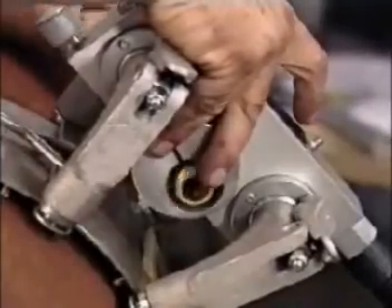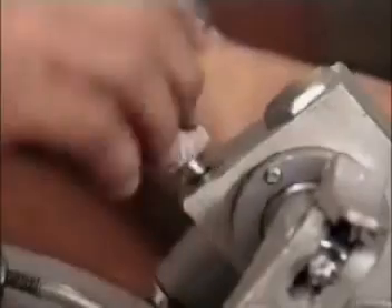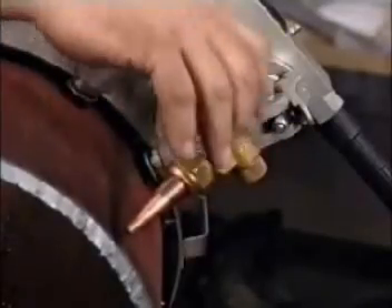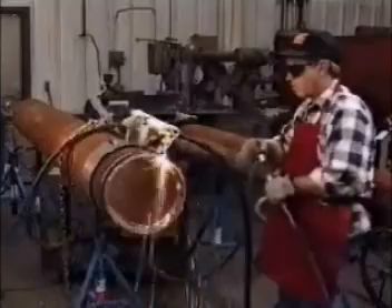Then secure the legs, making sure the crawler is not attached too tightly as this can cause irreversible damage to both the crawler wheels and the band itself. Place the torch through the torch holder eccentric. Tighten the eccentric, attach the angle head adapter to the torch, adjust it to the desired angle, and you're ready to cut.